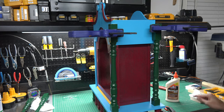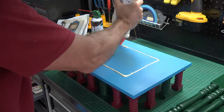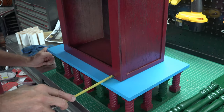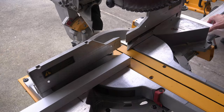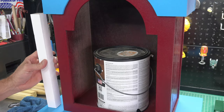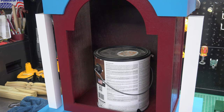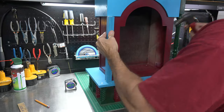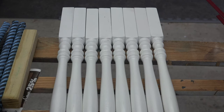To add a little more flare to the cap, I turned it on its face and traced out the arch to the circles, letting them extend the length of the width of the banister. I painted them and glued them on. I cut thin strips the same width as the top of each banister and cut them a half-inch below the trim I had just added above. I glued my banisters into position, painted the tops yellow, and set them out in the sun to dry. Once your paint dries, slide them under your flare, glue down onto your banisters, and clamp into place for a solid bond. I glued my top box into position, ensured it was evenly spaced around the square, then weighed it down until dry — later I added half-inch screws for more support. Back to the front of the face plate: there were pieces between the banister and the face plate, so I took some leftover banister, cut them to fit, cut multiple lines in each one on the table saw, spray painted them the corresponding colors, and glued them into position.